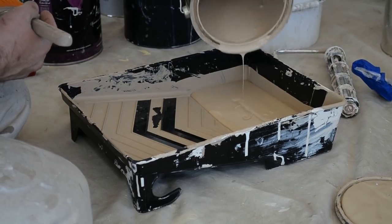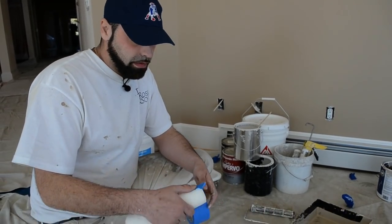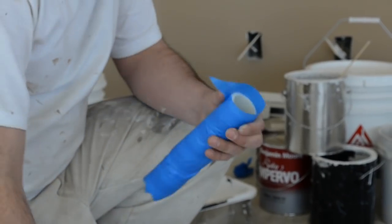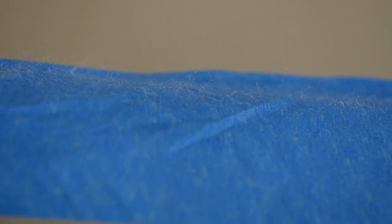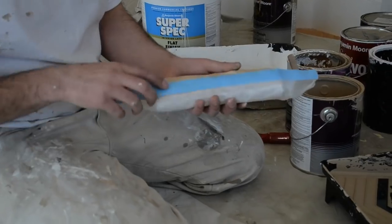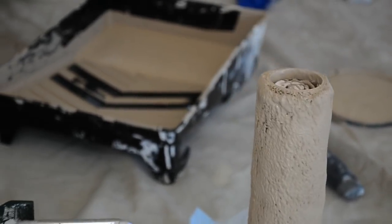Now that you've got all your prep work done and you're going to start putting some color on the wall, here's a nice little tip. Before you start rolling your color onto your walls, take a fresh roller nap and give it a nice little wrap with some painter's tape. What this is going to do is pull all of the loose hair and lint that's still part of the fabric — all that extra lint would have found its way into your paint and onto your walls and ruined your finish coat. Also, instead of wasting a perfectly good nap between coats, wrap it up with some tape and drape — it will keep for at least a few days without the edges getting dried. As soon as you take it out, it's ready to roll.